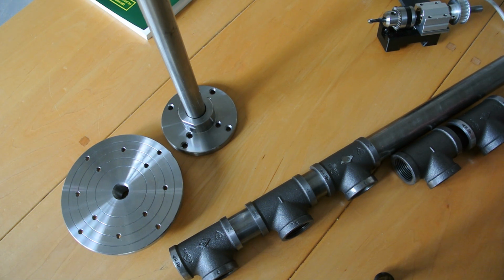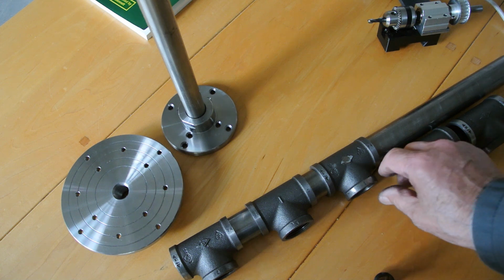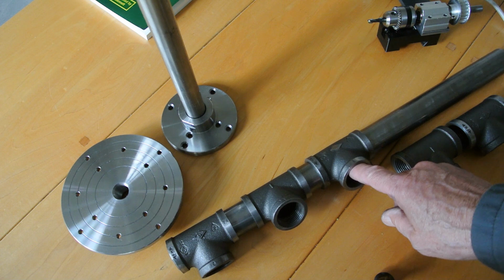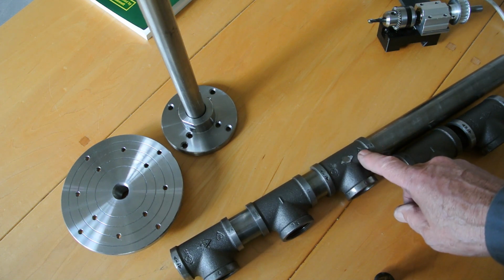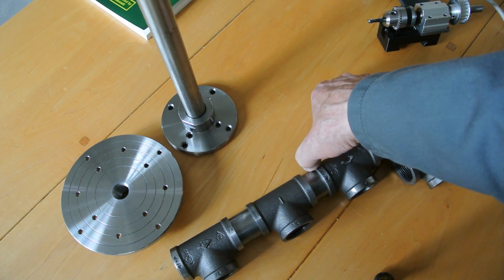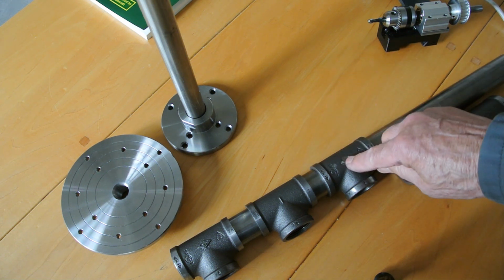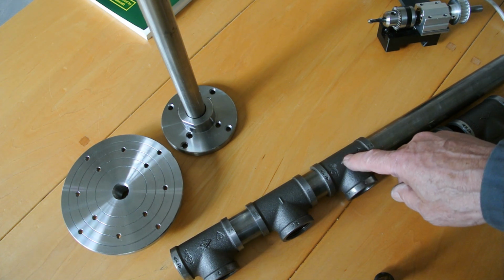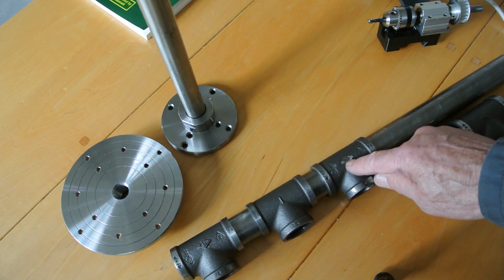And there's one more mounted on the lathe at the moment. So we'll go to the lathe and I'll just show you machining up the very wobbly casting. The most difficult bit to machine, I've discovered, is the inside of this one, which is at right angles, because you have to mount this into the four-jaw chuck, clamping there, and where I've cleaned the casting off, so that it gets a proper seating with the jaw, which is only just that deep.